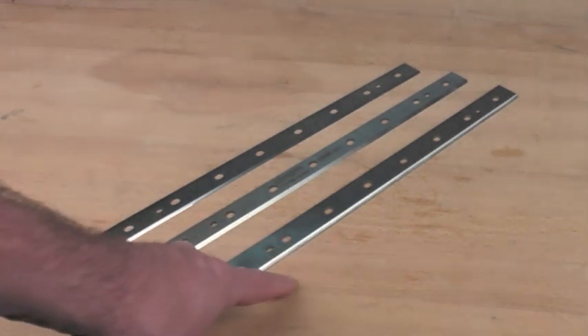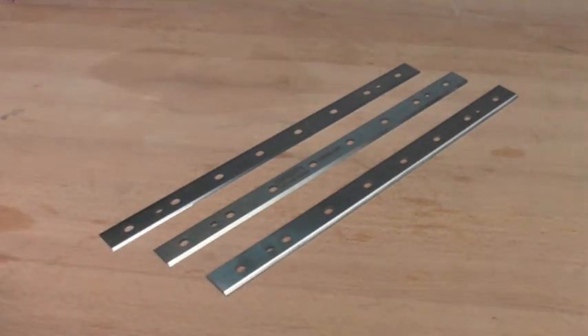While these knives are only single-edged, they will last up to 10 times as long as the OEM knives, plus you can lightly resharpen them one time. These carbide tip knives are a must-have if you are planing abrasive materials that would normally dull steel knives quickly. All this adds up to great value. Installation of our knives is the same as the OEM knives and uses the exact same hole pattern. Simply replace the knives with the respective gibs and screw them back into place.